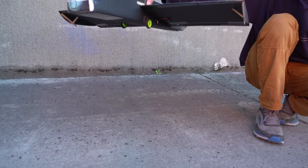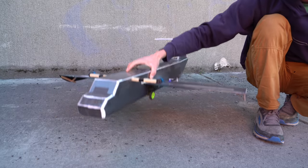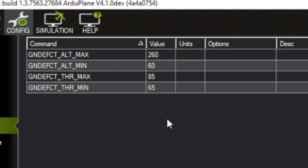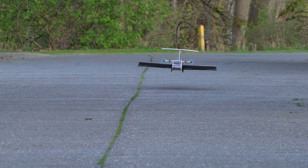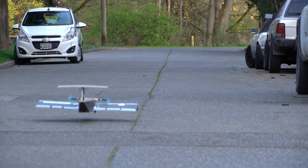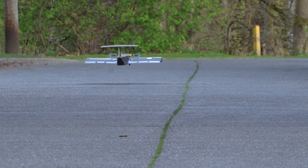Back to the video — Sebastian and I were still trying to figure out the best way to implement the ground effect altitude control. In ArduPilot there are four custom parameters: altitude min, altitude max, throttle min, and throttle max. These define a slope that controls your throttle based on readings from the LiDAR distance sensor. The slope can be thought of like the proportional gain in a PID control loop — the steeper it is, the more reactive the system gets. Our initial tests went really well, though it was a very calm evening, so the control system had fewer disturbances to fight against.